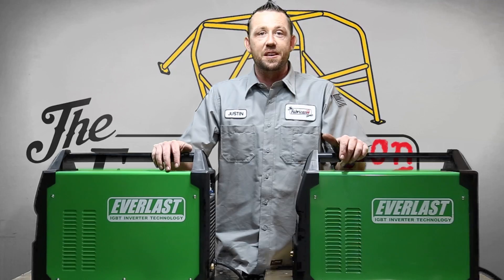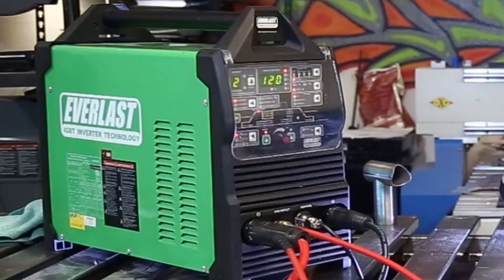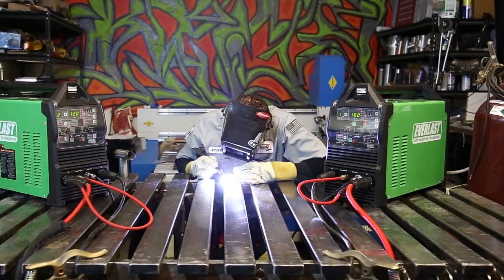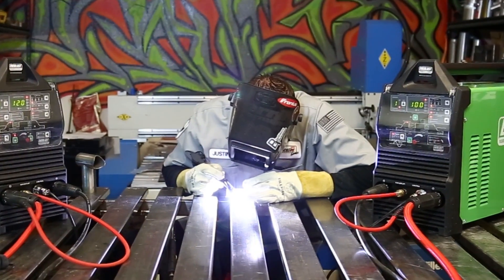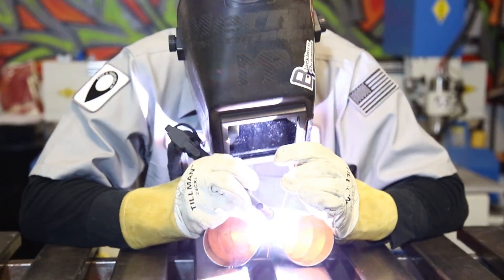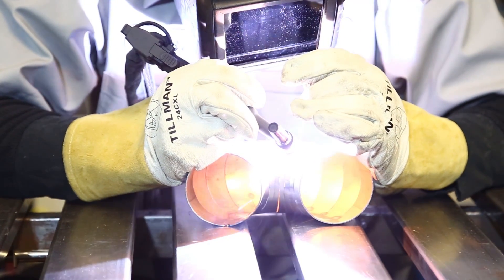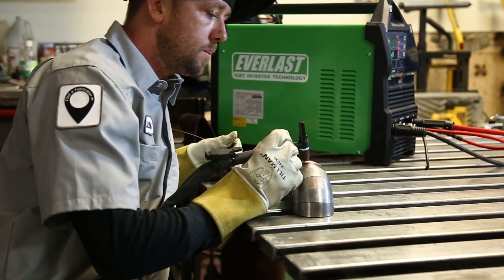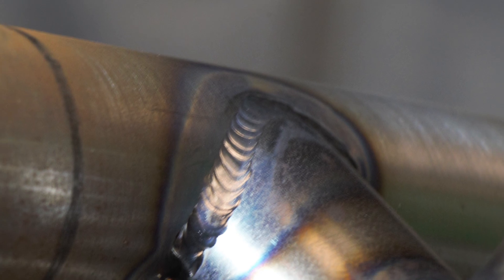Let's start with the 255 EXT. Throughout the course of this video, you're going to see the two machines up here — the 255 EXT on the left and the PowerTig 210 EXT on the right. One of the biggest features I look for in a welding machine — what really separates a good quality machine — is a great arc, fantastic control, lots of amperage, and a very decent price. That's pretty much what sold me on the Everlast to begin with. Let's take a look at two of the things I weld here the most. One being thin-wall steel — 16-gauge steel tube on some pipe. We'll get behind the lens and check out the arc: buttery smooth, nice and stable, absolutely no fits. Then we'll put it up on some roll cage tubing, standard steel, 120 wall thickness — just so smooth and perfectly buttery throughout, no fits whatsoever. That is really awesome.